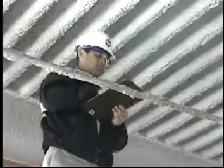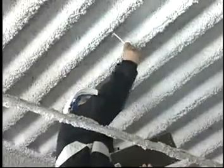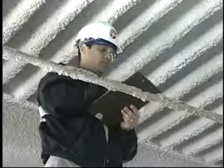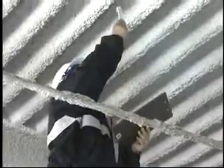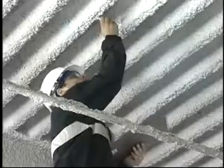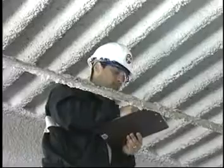Individual measurements that exceed the specified thickness by more than 1/4 inch are recorded as the specified thickness plus 1/4 inch. Any area where an individual measurement is more than 1/4 inch, or 25% less than the specified thickness, or where the average thickness is less than that required by the design, is considered a failed area and must be corrected by applying additional material. Each set of thickness measurements for the different structural members or deck section are then reported individually.